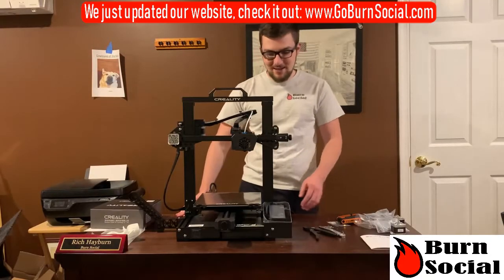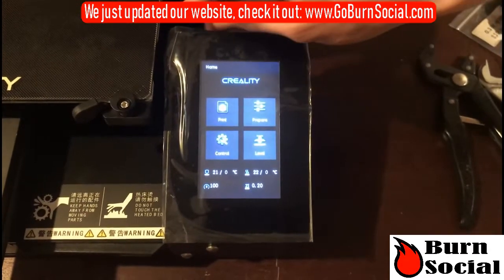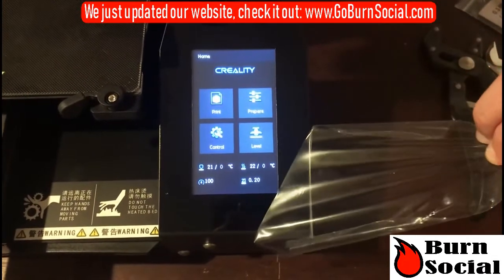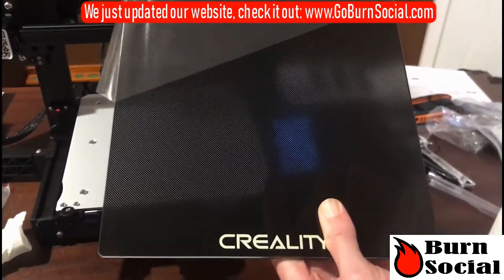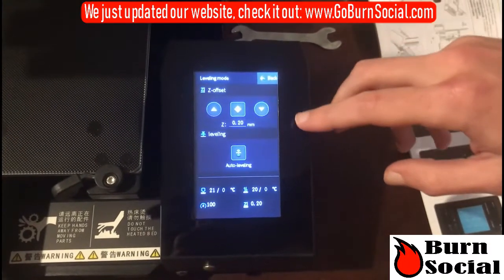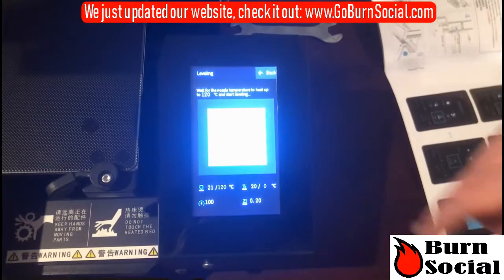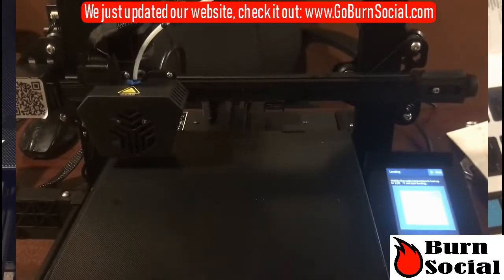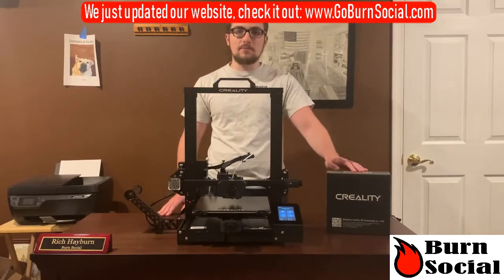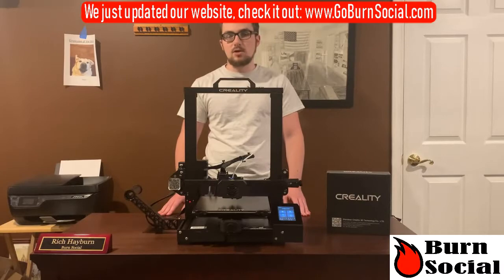Here it is fully assembled — looks pretty cool. Let's turn it on and see if it works. It does — oh my gosh, I'm so excited! So here's what the home screen looks like. First thing we're going to do — my favorite part of getting any new electronic — is peeling off the screen. Look at that! First thing we're going to do is test the auto-level function. You just click level, click the button in the center to home the Z axis, and you have the Z offset here which you can adjust easily. We're going to go straight to the auto-leveling function — tap it, wait for the nozzle to heat up, and it should handle it from there. For this print, we're going to be using the filament they included — white PLA, Creality brand — with stock settings in Cura: 200 degrees Celsius. Let's see what comes out.